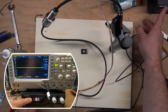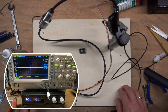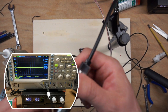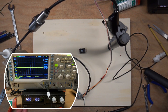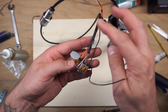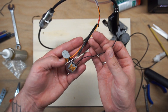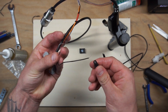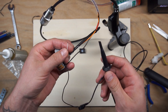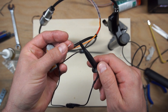We put 12V here as an input reference voltage with 1A of current, but for the sensor we don't need more. I already switched on the oscilloscope. The sensor is connected to the power supply — red is plus, black is GND — and we also have GND for the oscilloscope. Let's connect it and see what we have. White is output, so we connect it to the oscilloscope input.